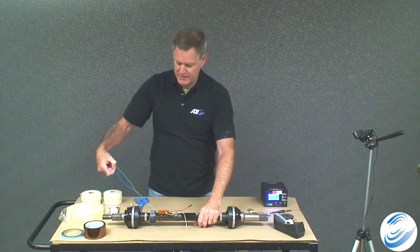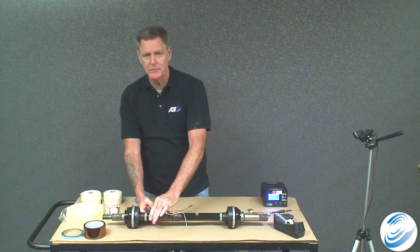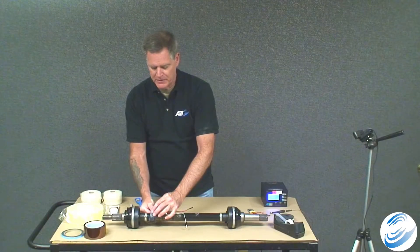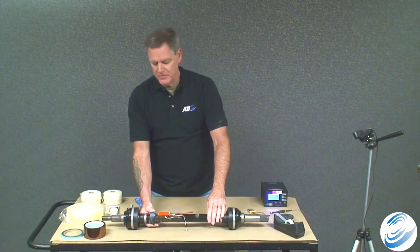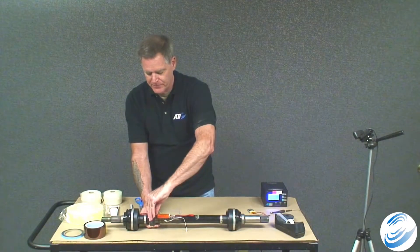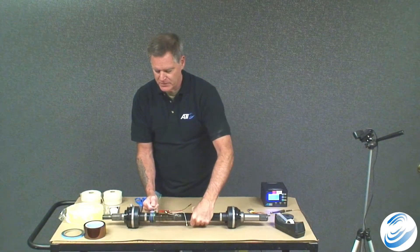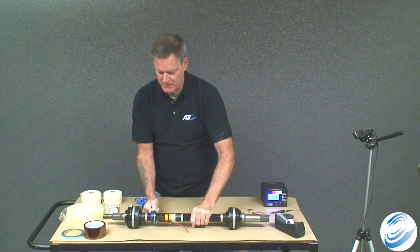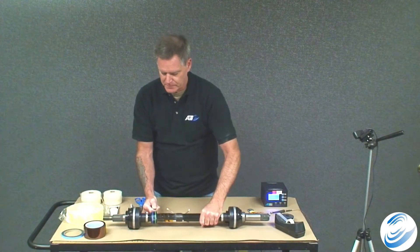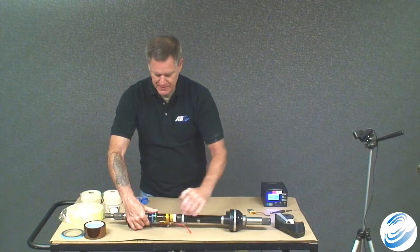With the antenna wires now on here, keeping in mind the direction of shaft rotation, wrap the wires around the rubber insulating piece. First make the angle, then separate the wires from each other by approximately three-eighths to a half inch apart. Take the beginning seam down, then holding the wires and rotating the shaft, place the wires overlapping each other. You can add a little piece of tape in between, and as you reach the end, take the ends down.